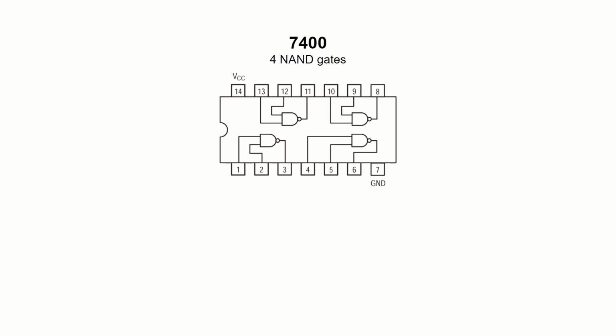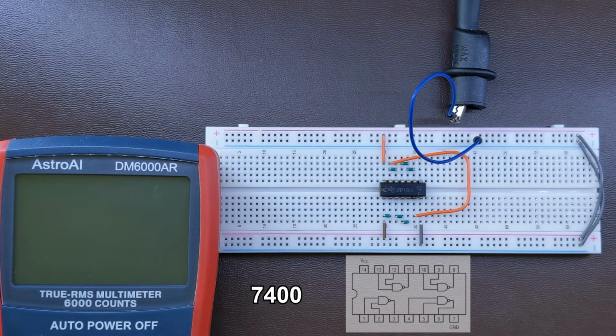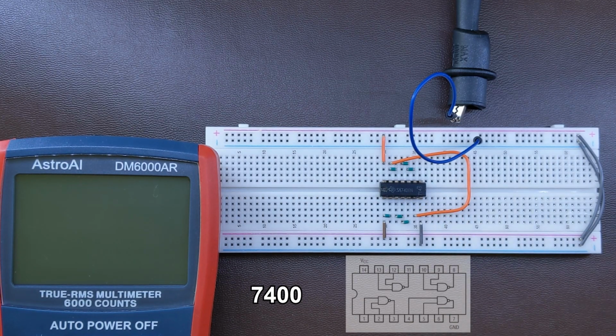If this doesn't tell you much at the moment, don't worry. We will cover this chip in the next video in more detail. For now, just remember that when we join and drive the two inputs of this gate together, we always get the opposite logic state on the output. For example, when we connect them to the ground or logic 0, we get logic 1 on the output. When we set inputs to 1, we get 0 on the output. So let's start our testing with the original 7400 family, which is the oldest one.